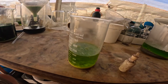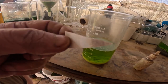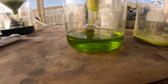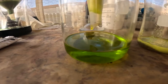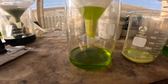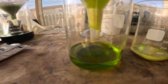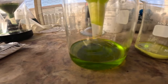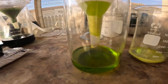It's the next day — it's all been heated and cooled down, now it needs filtering. I just did a stannous test and you can see it's positive for gold. Now I'll filter it and then we'll be able to drop the gold. It's filtering through nice and clear — it doesn't need a second pass. It was a very weak response to the stannous test, showing there's not a lot of gold in there. Usually if you get a really dark stain instantly you know there's a lot of gold, but it took a few minutes to show, which usually means a very small amount.